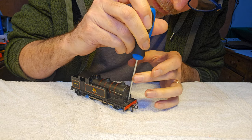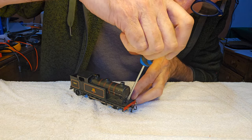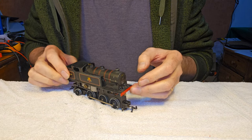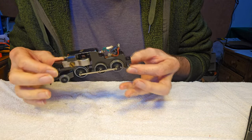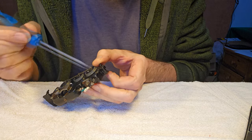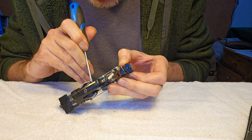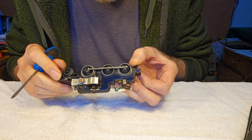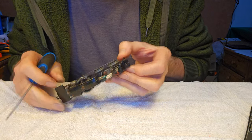Let's get a look inside. You can see why this paint gets scraped — it's very hard to undo that screw without scraping the body, but you should try. Yeah, there's a lot of oil. Oh, we've got a broken wire here — that's interesting. And that wire's broken too, so that won't have helped matters. The armature's got quite a bit of play in it. Brushes look okay. Usual dirt in the commutator. I think I'll clean it up, re-magnetise, and it'll be okay. We'll sort that wire.